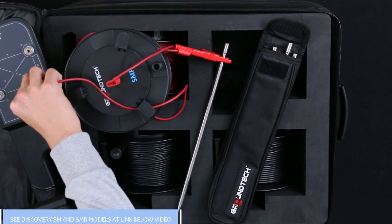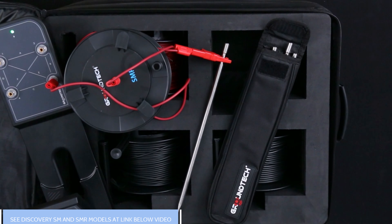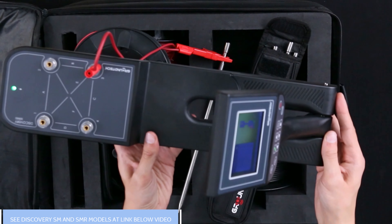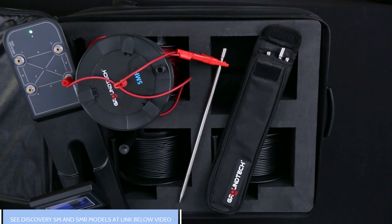You can clean the conductive probes with a damp cloth after scans to prolong their lifetime. A final and important warning: resistivity scans transmit 110-volt electric current to the ground. Do not touch the sockets or plug-in cables once you initiate the scanner, otherwise you may be seriously injured.